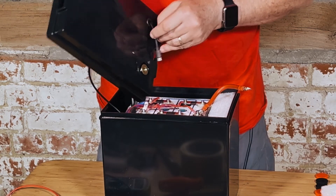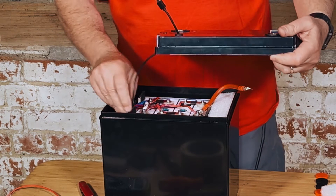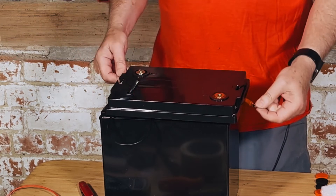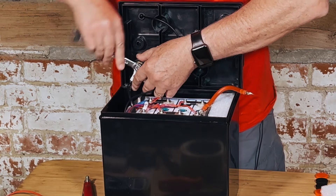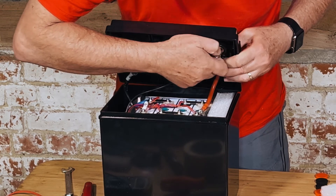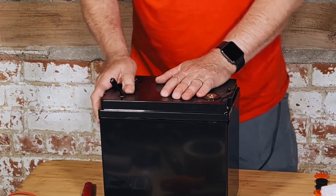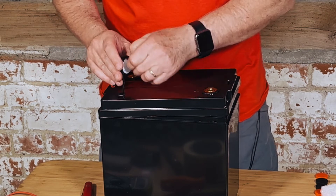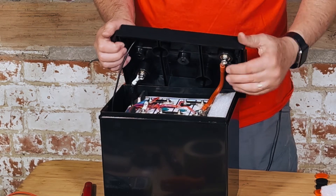The grommet is nicely and fairly neatly seated. We'll be able to tie this off once we get the lid down. We then tightened the two terminals and bolted the wires onto the battery lid — the black from the BMS onto the black terminal on the case lid, and the red from the battery cells to the red terminal on the case lid. Just hand-tightened for this prototype. We then connected the Bluetooth module, which has the on switch to turn the BMS on, and used small 3M-type sticky circles to mount it.